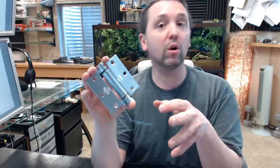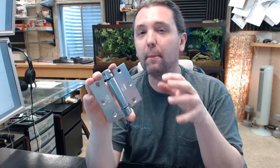Now, I'm a fan of all spring hinges, and it's not for the obvious reason, but more so for the fact that I've installed spring hinges, set them, adjusted them, and modified them over time, meaning the conditions that you'll have in springtime are different than the middle of winter and summer as well. When you have more spring hinges on a door rather than less, what you're accomplishing is a better, more predictable and reliable door operation. When you set the tension on a spring hinge, we'll go over that in a moment, when you open the door, it stores energy in that spring. As the door is at, let's say, 90 degrees, and you release it, that stored energy is released and the door begins to close. But that spring hinge has to overcome a lot of obstacles to get that door moving.